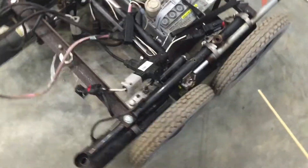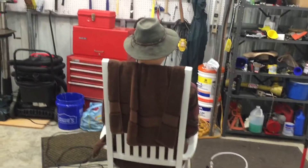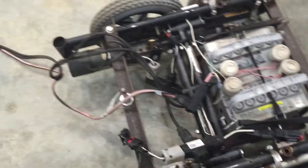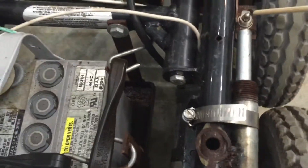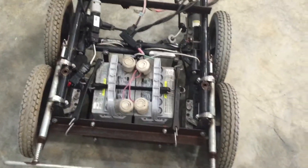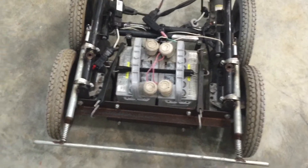For safety, I made this bumper switch here, if you can see it. The way it works — if you look carefully here, I've got a toggle switch right there and one on the other side. I made this switch assembly spring-loaded, so if you run into something and hit it, it sets the toggle switches off and stops it. You really need to do that if you're going to build one of these, because this thing has enough power and mass behind it that it could mess up a pet or a small child very easily. And we certainly don't want to do that.